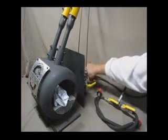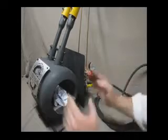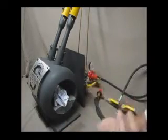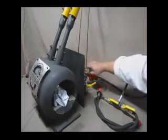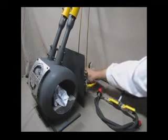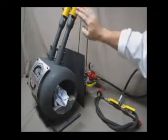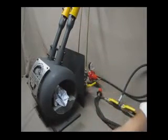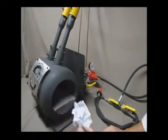You would then reach back onto number three, the ball valve, and obviously don't stand right in front of the blast of flame. This is a heat shield, use it. Go and stand on the side of the forge. That's burning well. Open your needle valve. You'll hear the pressurized gas going through the burners, through the nozzles, down the burner tube and igniting. 99.9% of the time, what happens on ignition is the piece of paper gets shot out of the forge.